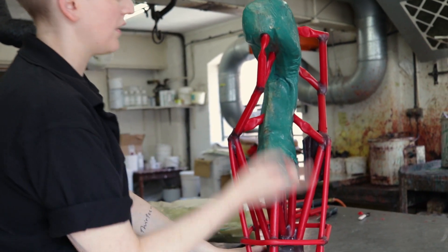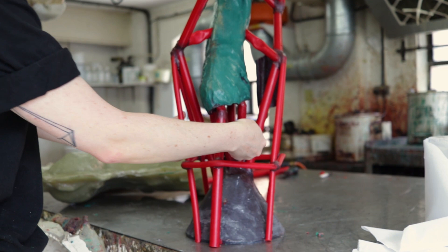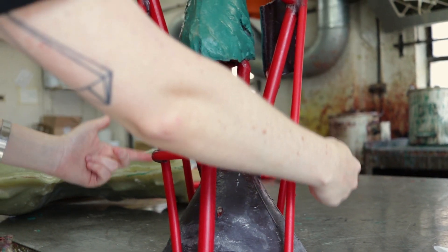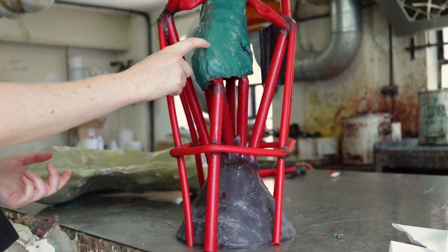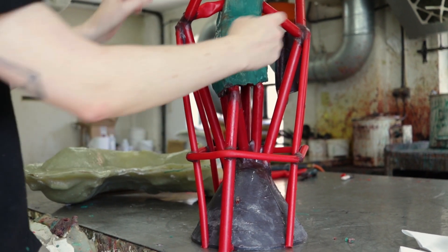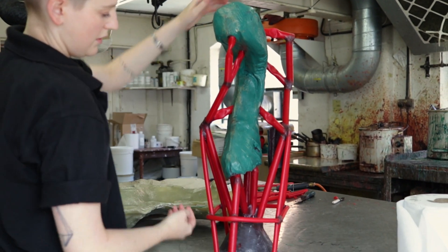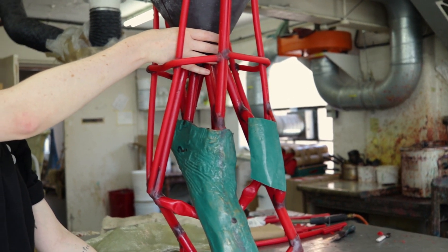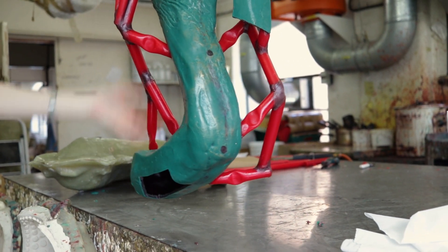It works upside down. This cup ends up acting as a funnel. These central pieces of wax are runners and the outside ones are called risers — that's where the air can escape. The runners are where the bronze runs into the actual object, so they're feeding directly into the piece you want cast. The bronze travels through the object and escapes through the risers, which is why it works upside down. With gravity, bronze pours down through the main tubes, through the object, and then escapes back up out of the tubes.